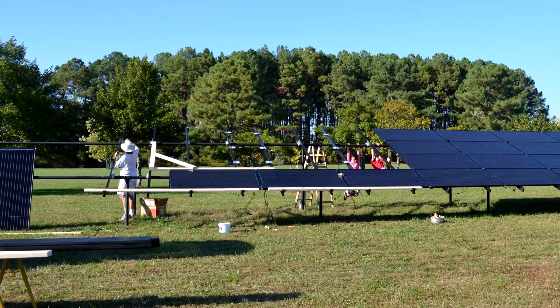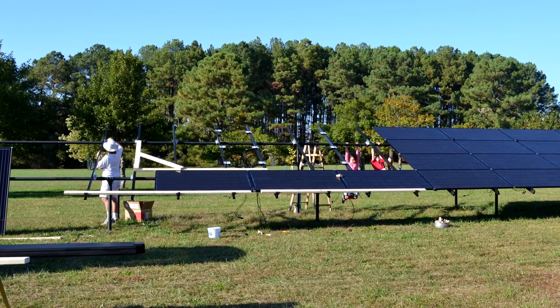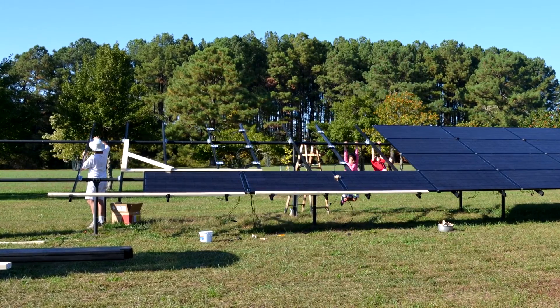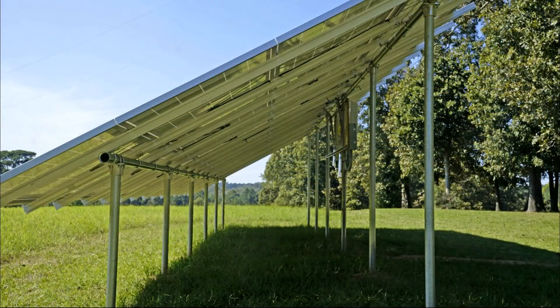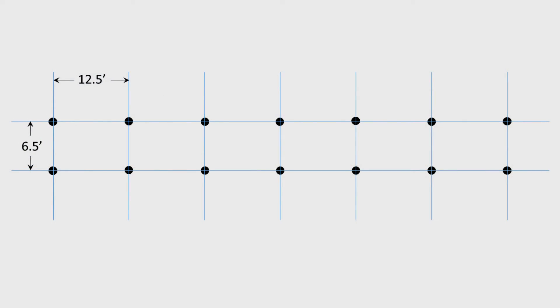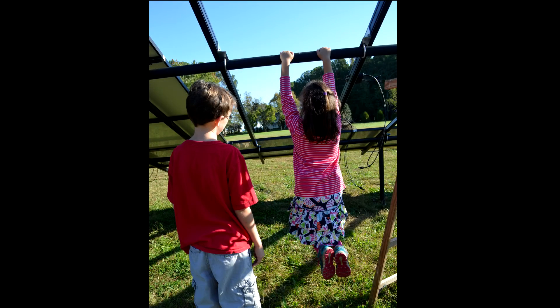For this design, the panels are mounted in a landscape orientation. My personal preference is to place the landscape-oriented panels in columns, four high, with each column centered on two 14-foot-long IronRidge mounting rails. Studying photos of other similar projects, I saw that 2-inch vertical pipe supports were frequently spaced about 10 feet apart in the long direction. However, I felt comfortable spacing the pipes 12.5 feet center to center, and I'm satisfied the design is both rigid and strong.